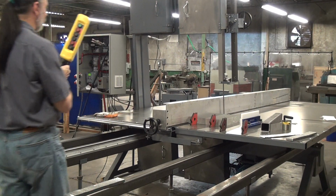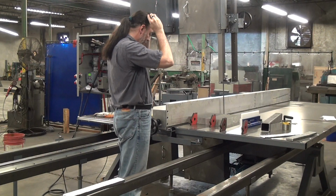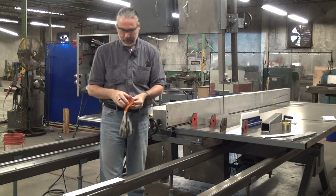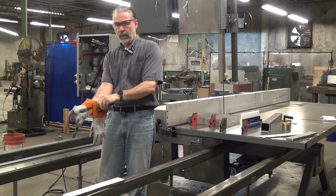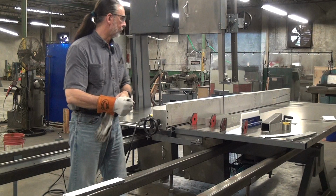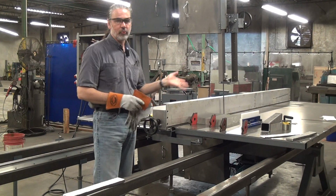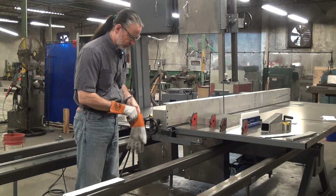So what are we cutting today? Why have I tilted this blade forward by 5 degrees? The customer for this saw, and I actually have many other customers cutting this material, is cutting a honeycomb material. Comes in a lot of different types. This table is actually set up to cut through up to a 10-foot long workpiece. So the 120 inches, the actual table travel is 11 foot to allow you to cut through a 10-foot workpiece with a little bit of excess on both ends.